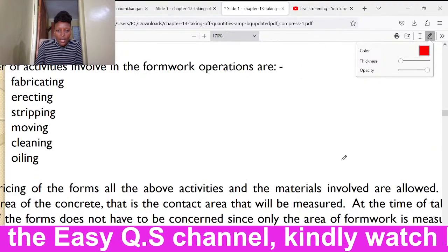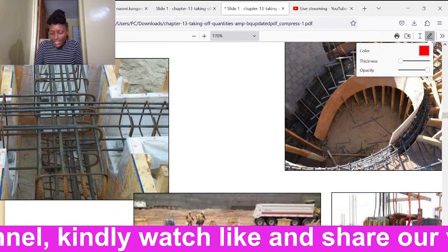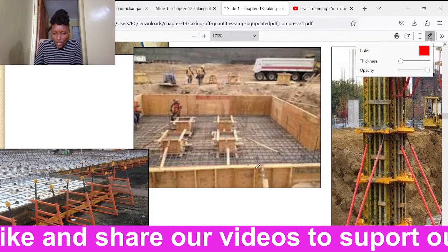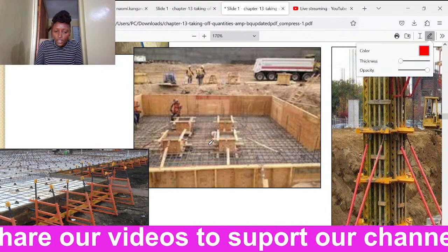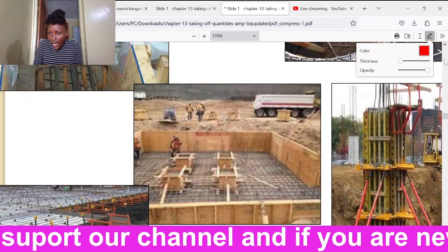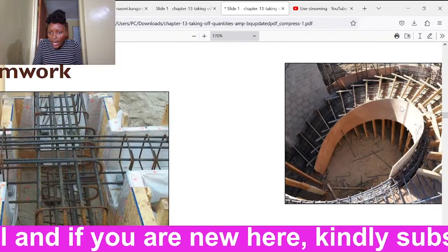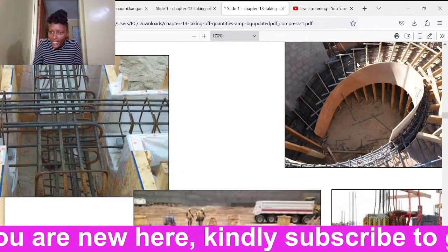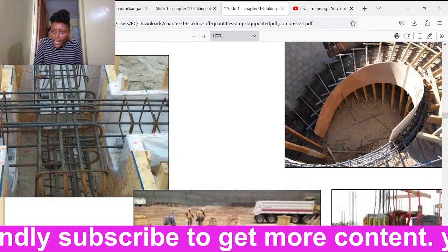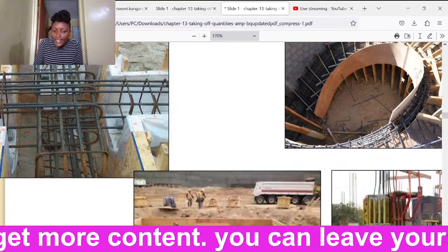All right, that one we have already finished. So we shall go directly. These are just examples of how formwork is usually done. We all know that we first lay the formwork, then we do the reinforcement, then we finish with the concreting. This is an example of how we do formwork in a staircase. We do the formwork, we do the reinforcement, we do the formwork again up here so that it can shape the risers.